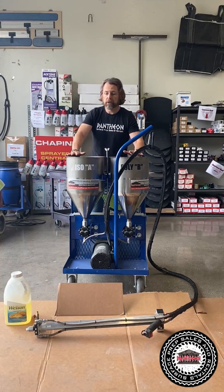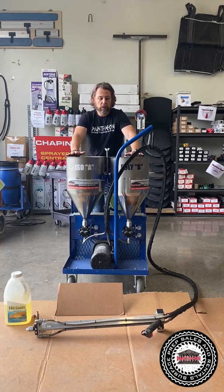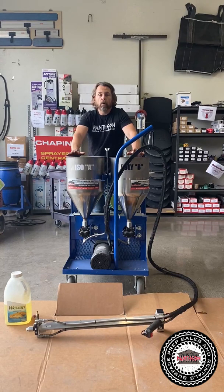So you pour your material in, you wanna get it as even as possible in here. You always mix your B side, or I'm sorry, your color side, your poly side before you shoot your material. You don't have to do that with the A side. A side does not need to be mixed.